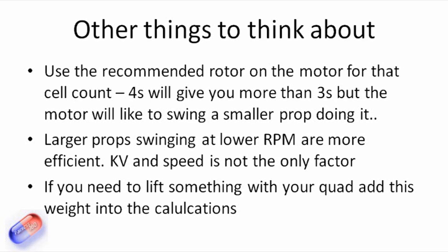Don't get hung up on some of the numbers — look at the thrust that's available and go with the specs. If you want to lift something with your quad, add that weight into the calculations. If you're expecting to put camera gear and other bits and pieces on it, weigh all that stuff, add it into the calculation before you double it, add your 20%, and then divide that amount of thrust by the number of motors. Build that in from the start and you'll never be stressing your system or risk an ESC or motor letting go with expensive cameras hanging underneath.